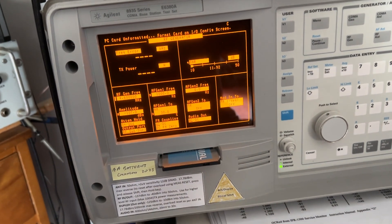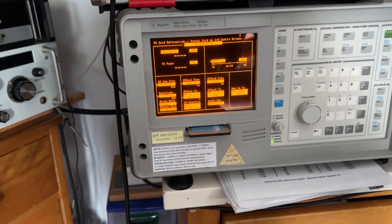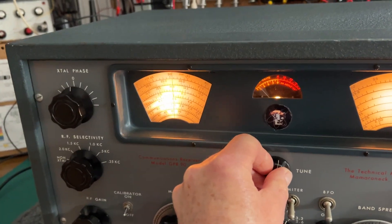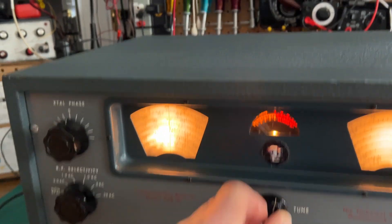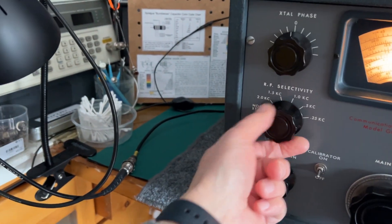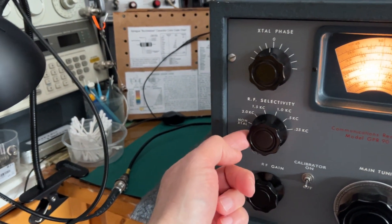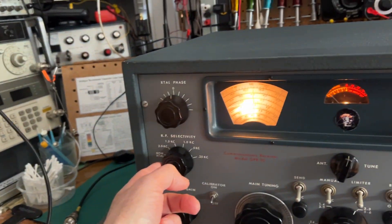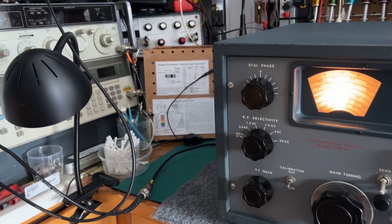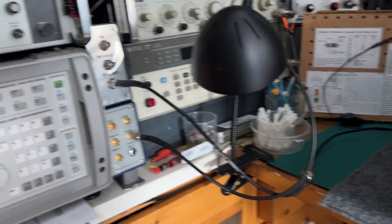The reading is between 10.5 and 12.5 — hovering around there with a little bit of noise in the background. I've got the signal peaked. There's no crystal IF filtering; it's quite wide, about 8 kilohertz at minus 6 dB in the non-crystal selectivity position. I have the audio filter in at 1200 hertz, just to lower the general overall background audio noise a little bit.